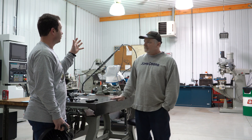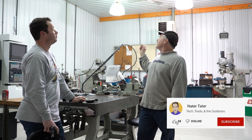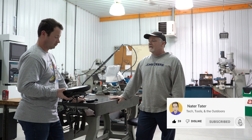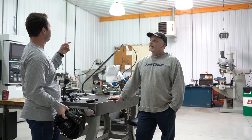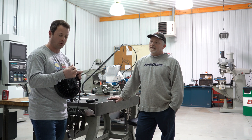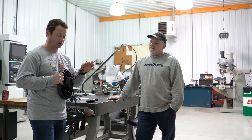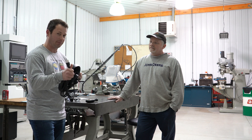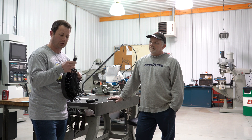Right now there are six lights in here in this 24 by 40 space. The barn was built about 15 years ago and the lights were put in at the time — they were much brighter then. We've been waiting for LED technology to mature to a point where we could save money and put out a lot of light. Each of these existing fixtures is about 400 watts on 220. The new LED unit has a 110 plug and also has wires for a dimmer — a 0 to 10 volt or 1 to 10 volt dimmer circuit — but we're not going to hook that up. We'll run these full tilt. They actually accept 110 or 220 input, up to 277 volts, but we want to use 110.